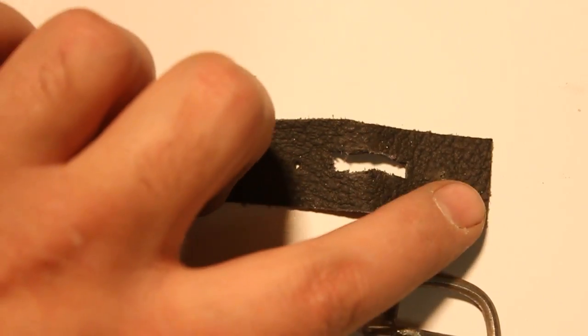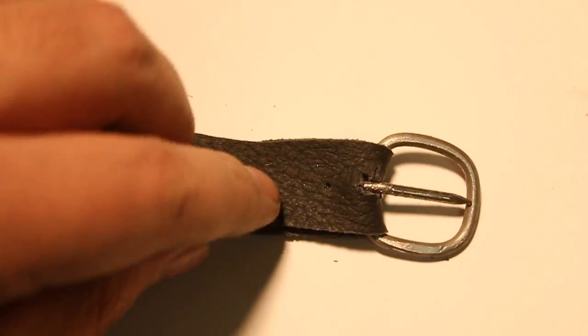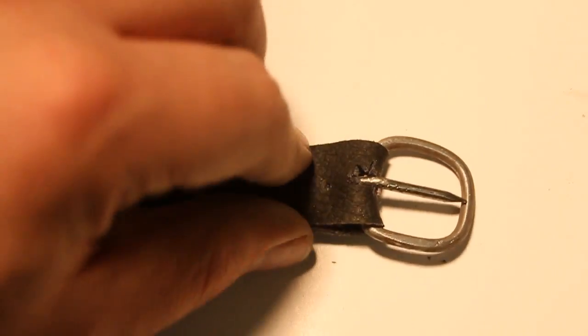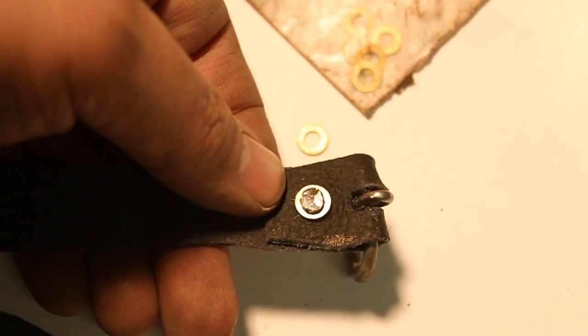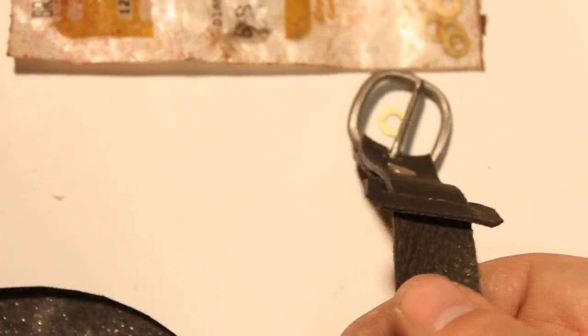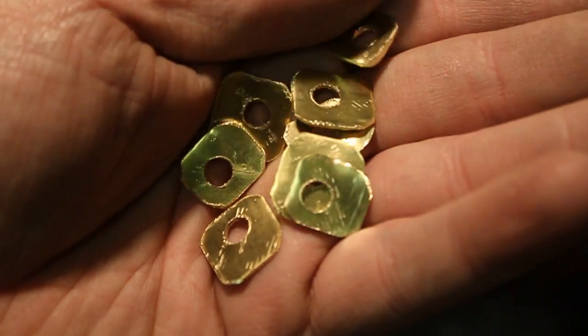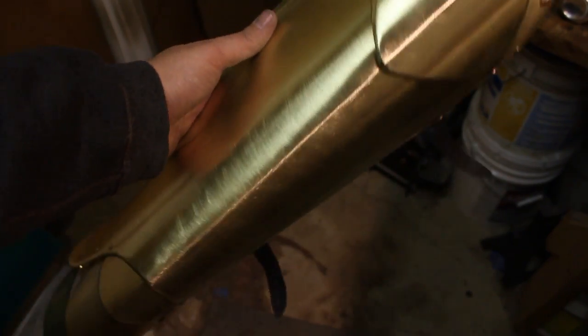Here I'm making some simple buckles. You've seen me make these before. They're made from some bent rod and some nails. Very simple, very easy. You could of course buy your own small buckles, but what fun is that, right? You can see I'm using a nail as a rivet here and a little washer so it doesn't pull through. Here's a little leather guide for the other strap once you've buckled it to make it neat. I had to make some of my own washers where the leather straps are connected with the copper rivets.